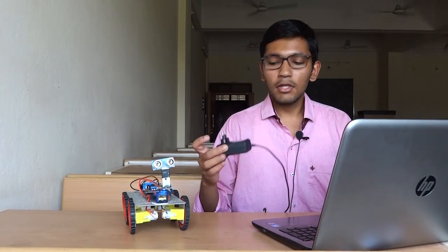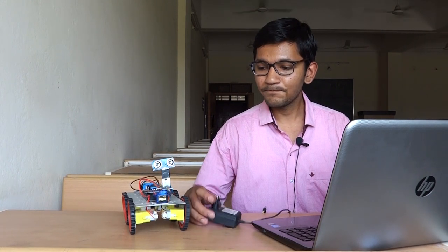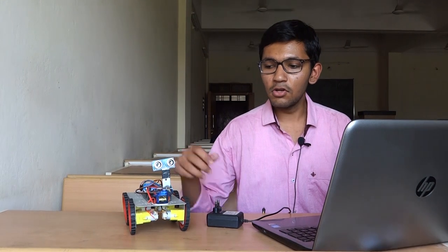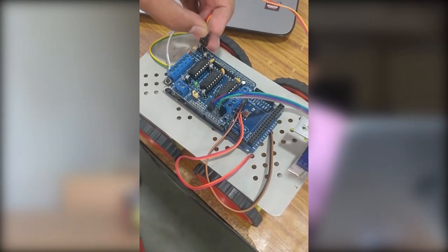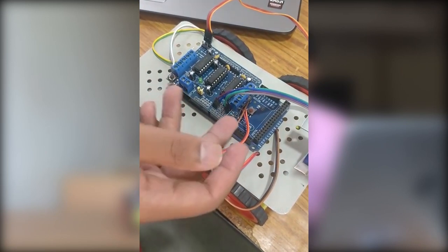I am Shyam Singh. In this project we have used a DC power supply with the help of an adapter which provides a maximum 12-volt supply. The servo motor is an assembly of four things: a normal DC motor, a gear reduction unit, a position sensing device, and a control circuit. Above this, an ultrasonic sensor is mounted. The ultrasonic sensor emits ultrasound at 40,000 Hz which travels through the air, and if there is an object or obstacle in its path it will bounce back to the module. The motor connections and ultrasonic sensor connections are made on the motor driver shield.